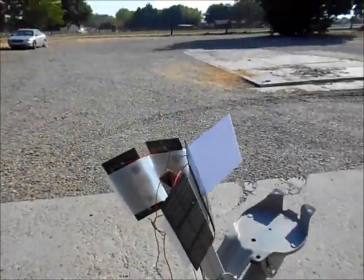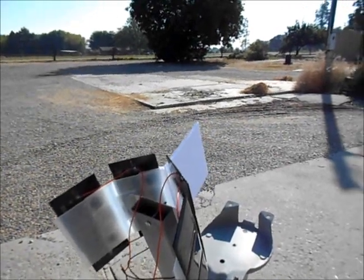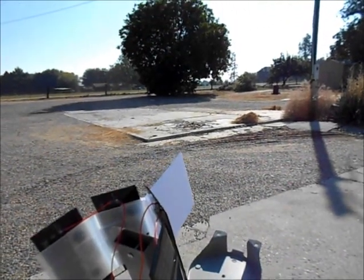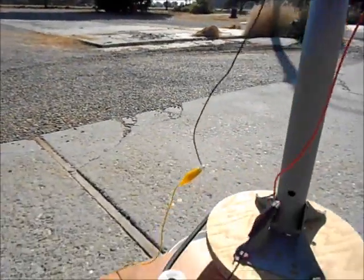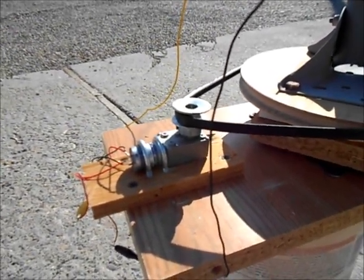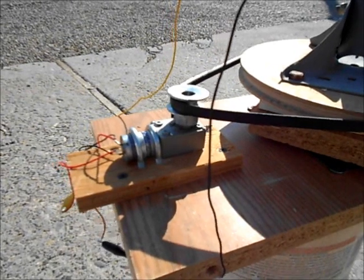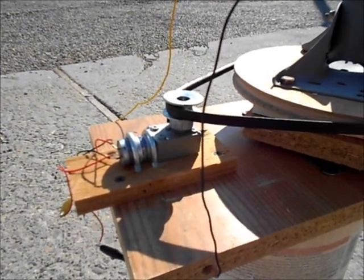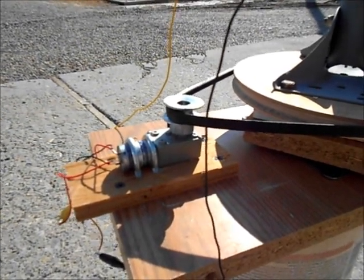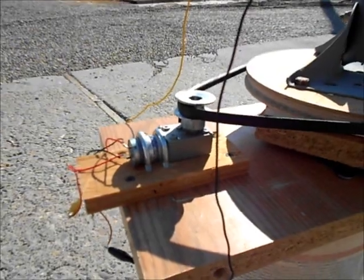So how does this work? The panels or solar cells are wired together so that everything on the left side works together and everything on the right side works together. They are wired to the motor so that when the left cell set has more power coming in from the sun, it turns the motor one direction. When the right side generates more power, it turns the motor the opposite direction. The two panels work against each other — whichever one is getting more power wins and turns the motor that direction. Very simple setup.